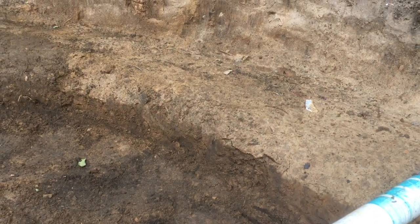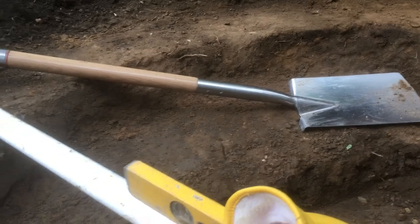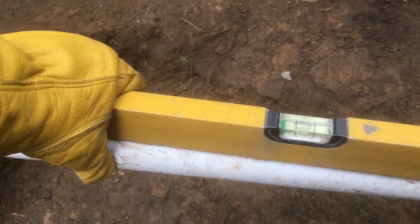It's fairly basic engineering. Water will level itself out. So if the edges of your pond aren't spot on level, you're going to have either exposed liner, or some rocks will be sat in the water and some will be sat out of it. You know, it's going to be all over the place and just look amateurish.